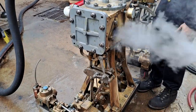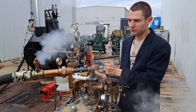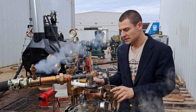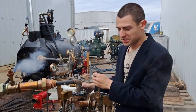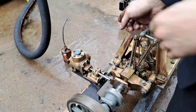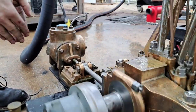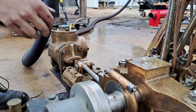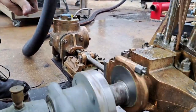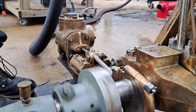And that's the cut off. These engines, even with a flywheel on them, will not run smoothly really unless they're against the load of a screw propeller, and more importantly, with the vacuum of a condenser on their exhaust end. This engine's got its wet air pump right here. This is a double Edwards type. It works like an Edwards, except the bucket is double-ended. It pulls a vacuum and withdraws condensate from the condenser in both directions, so both directions can suck on one stroke and feed to the hot well.